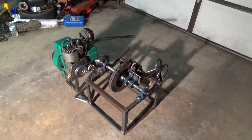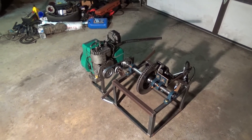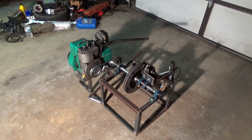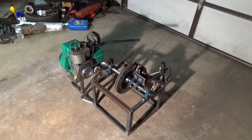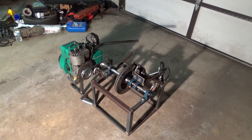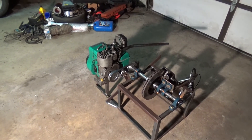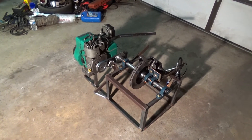I'm going to start pumping out a ton of videos using this dyno because I want to do some oddball stuff. Like, I've got a GM supercharger. I plan on belt driving it off that engine or the 8 horse Briggs and do an A-and-B test — before supercharging, after supercharging — and change pulley sizes to see how much boost pressure changes and power differences on the dyno. I want to do head work too. I have the ability to weld aluminum now, so clean up the head, weld it up, use a mill to change the chamber design and change the compression ratio. One cylinder engines — I used to when I was younger also weld up and regrind my own cams, and I'd like to try that too.